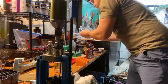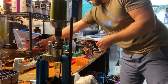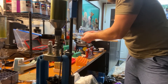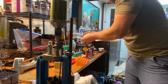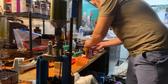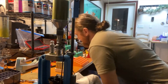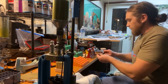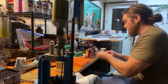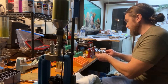Didn't trim too much off that one — it might be out of calibration. We'll check it one more time. It's trimming a little bit. Okay, so we've got the Cam-Lock trimmer worked out. Now we've got the cases trimming down to 2.485-ish, which I'm happy with.